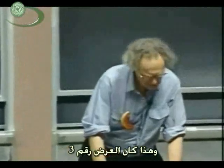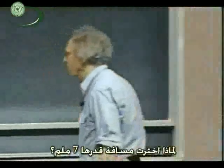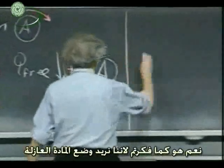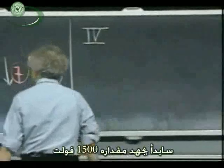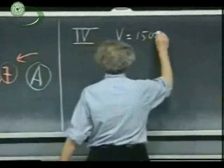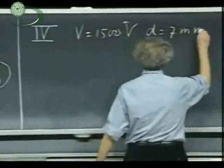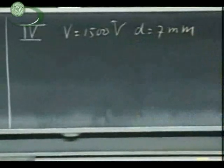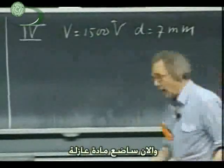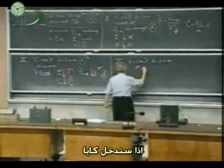So that is demonstration number three. Why did I go to seven millimeters? You've guessed it. Now I want to plunge in the dielectric. So my experiment number four: I start with 1500 volts. I start with D equals seven millimeters. And I'm not going to change that. There is no dielectric in place. But now I put the dielectric in — so kappa goes in.